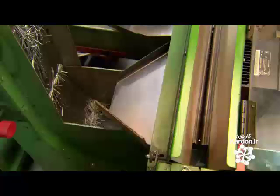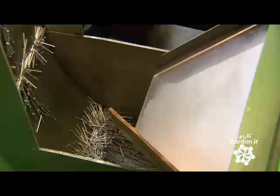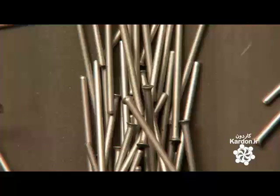The rivet stems are also on the move. They travel through a channel that gradually widens to sort out stems that are too big or small. The undersized stems fall through at the beginning, and oversized ones fall off the end. A magnet loader collects the correctly sized stems, and the rejects are discarded. The rivet stems cling to the loader, which has been stopped for our camera.